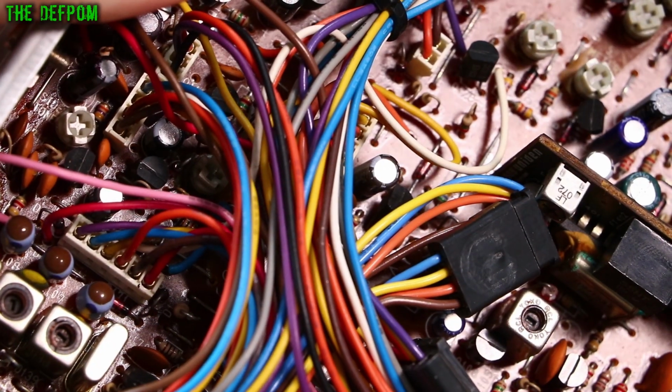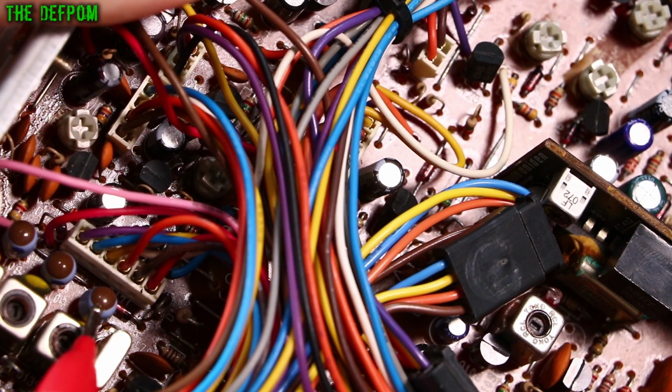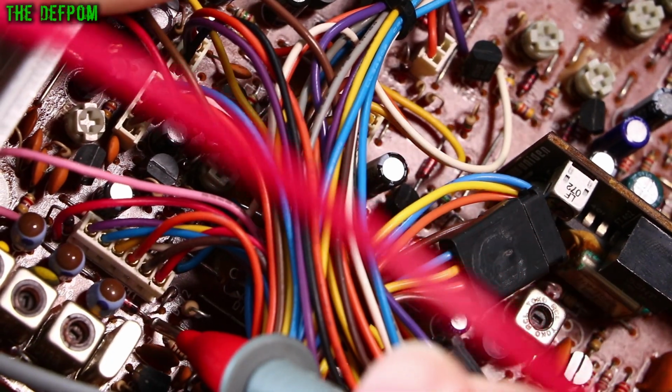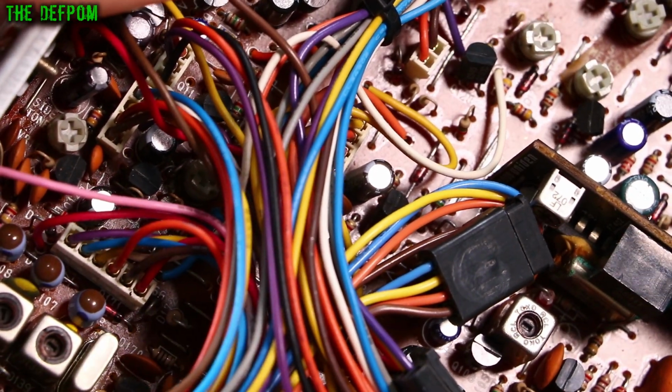Well, I'm going to try and show you where the diode is. So I've got these inductors over here, which are filters to stop RF leaking out of the switching system where it supplies DC in. And just there is a diode, right there. That is the one I'm talking about. That's D171, right there, just down the back there, and that's the one which is not working properly.